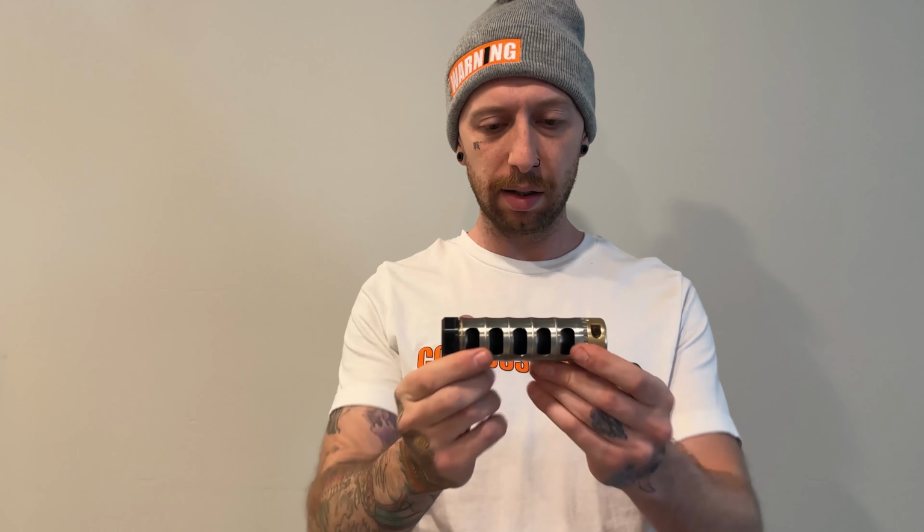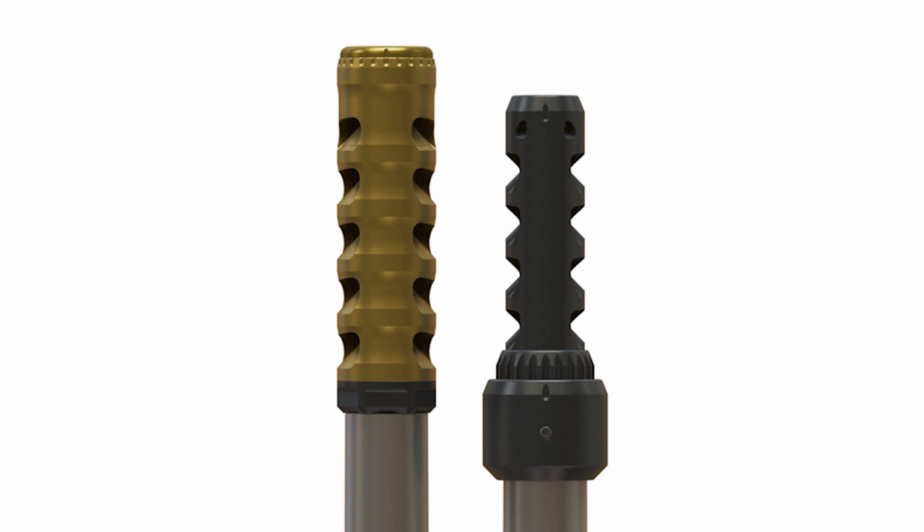So the ideal width for a 30 cal muzzle brake is 5 inches wide, which is absolutely ridiculous. That's wider than this is in that direction, and it would be enormous and unwieldy and just stupid. However, once you do the maths and figure out the point of diminishing returns, you don't need to go quite that crazy to achieve significant performance boosts over a typical 1 to 1.1 inch muzzle brake.